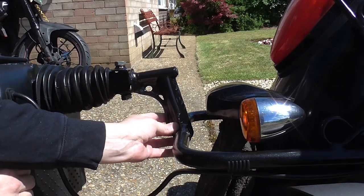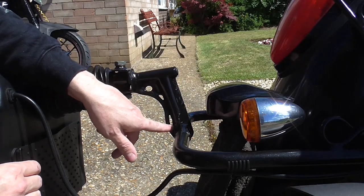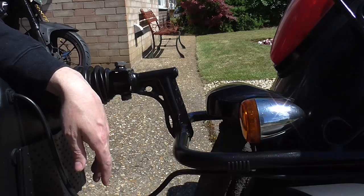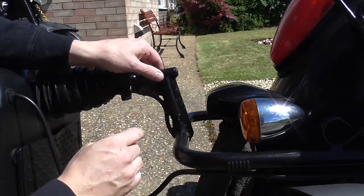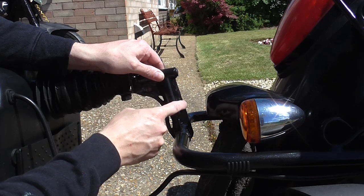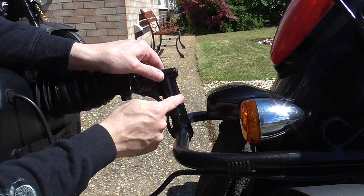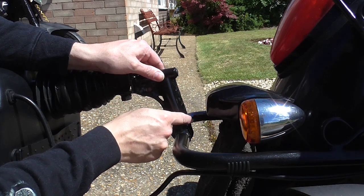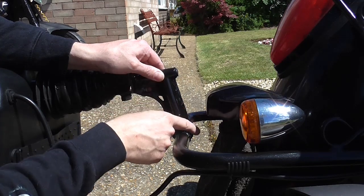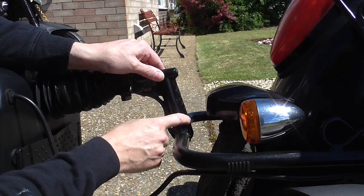Basically my welding on this bit — there was a big splodge of metal here and this basically held it together. So this crack was here and there was compression here. What I needed to do very quickly was take all this off, and I basically took a rod of steel — I think it was mild steel — curved it around here, and then welded it up. I used tack welds until I had enough weld there to hold it. Basically I joined the top of this tube to the main tubes as firmly as possible.